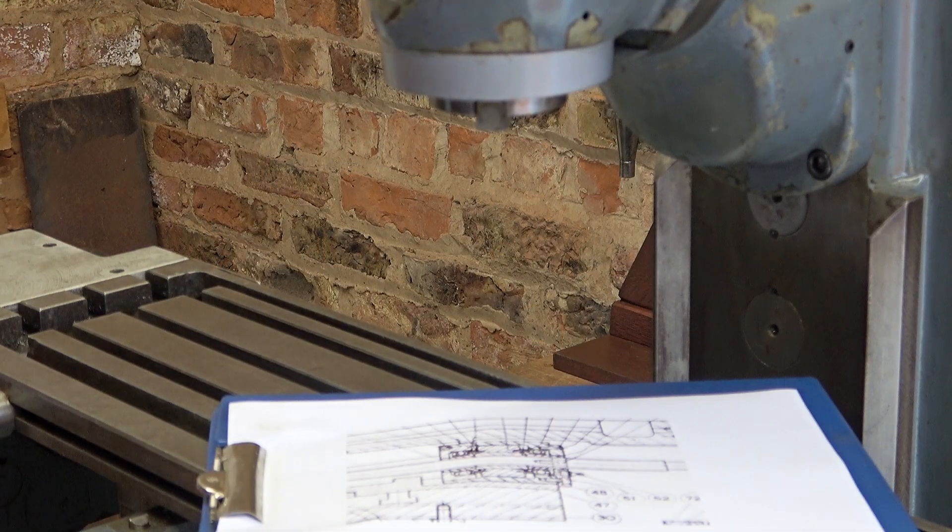More evidence of an accident — can you see that face there? The part I'm going to show you now is broken off. It's not going to matter luckily, because that part's not even threaded and the screw's plenty long enough. But something's happened. Right, that's the cartridge as I call it. I think these three screws hold this plate onto this body here. I'm not going to touch those because I know there's a securing ring at the back, and there's a small grub screw. Take that out and the ring unscrews, and then the unit comes out from inside the body.